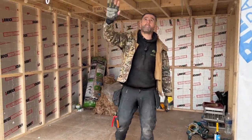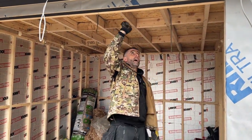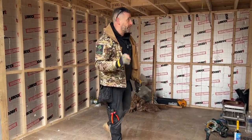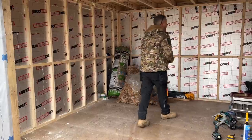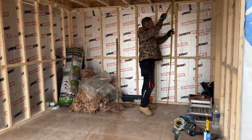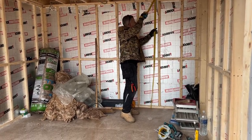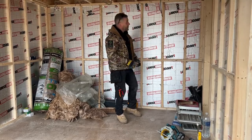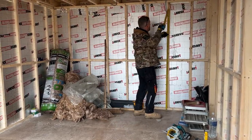He was surprised that we put in this big steel. It's a 160 steel. That's why we're using 5x2s and not bigger. And that's why we're using 4x2s and not bigger in the floor, because you will seriously compromise your headroom internally. I am 5'8". The back of this building is 81 inches, which is 2050. But by the time you've got a floor covering on there, plasterboards on the ceiling, that again is going to be reduced. So if you are 6'6", let's have a look.